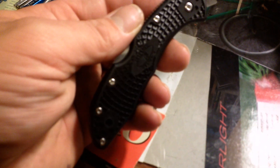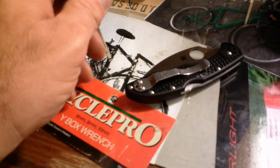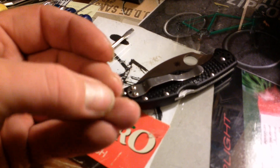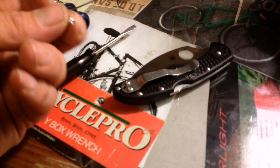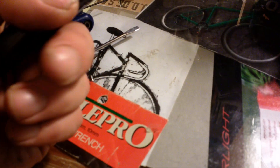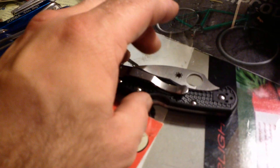So if you do get one stuck, remember you can use an Allen key. If that doesn't work, it's always possible to cut a slit to facilitate the use of a flathead. The thing you want is to be very careful to go really slow with your file and not have it slip. So there is an option for removing these that doesn't involve any kind of fancy tools — just a file and a flathead screwdriver.